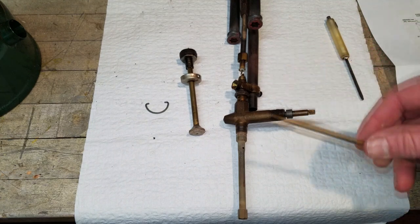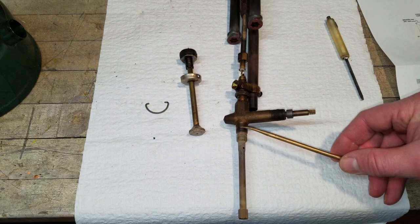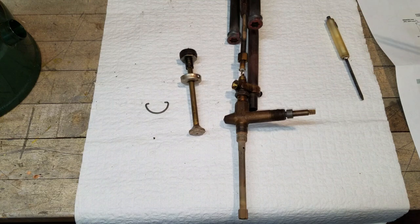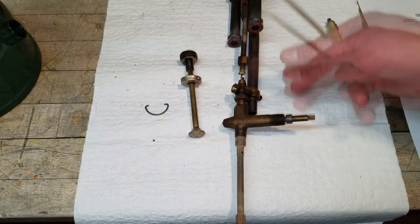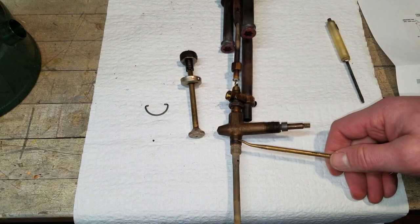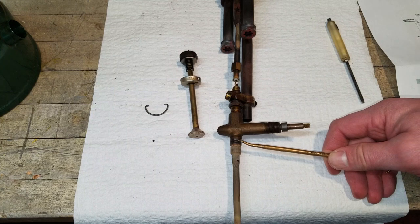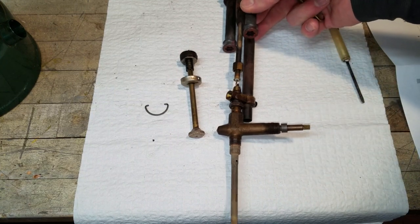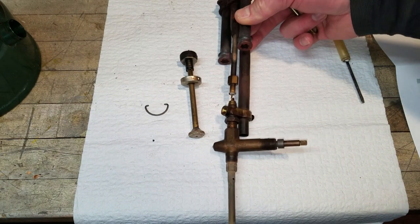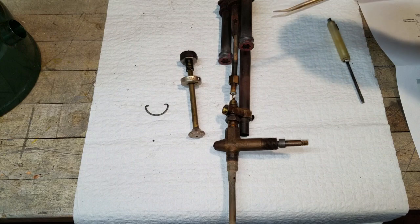As a note, this part, which threads into your tank or fountain, the fuel tank, I call the fountain just so you know what I'm talking about, does need sealant compound. I prefer a sealant compound, a liquid type, not a Teflon style. That is a preference and a recommendation, not a requirement. So leave your comments to yourself, people.